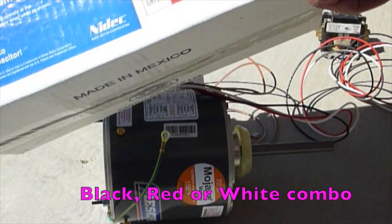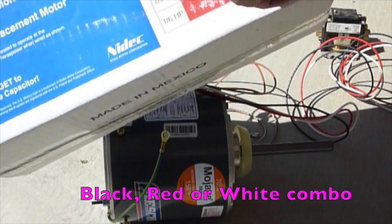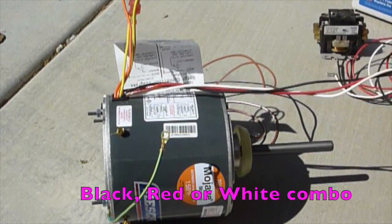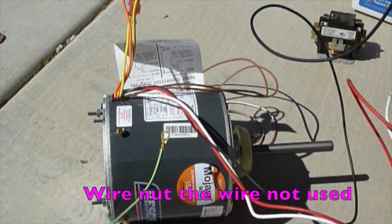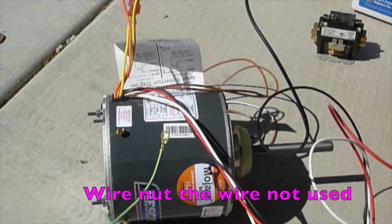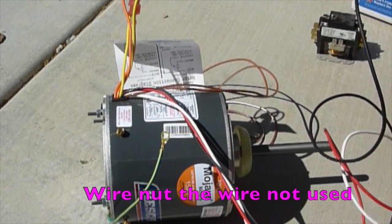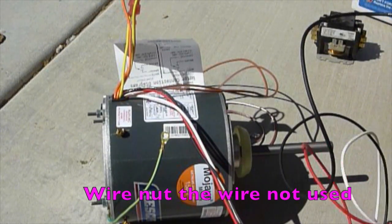On the wiring of these units, your box — whatever brand you're using — is going to give you the wiring diagram. A quarter horsepower is going to use the black and red. Make sure you track back where your wires are on your original unit so you know where to run to. If at all possible, you want to run the two wires all the way back.